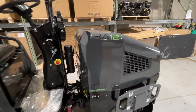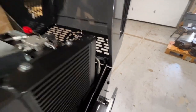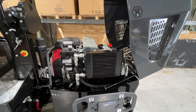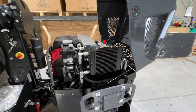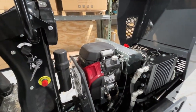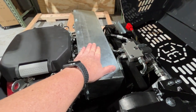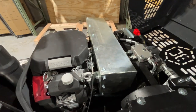Let's take a look under the hood and see what powers this bad boy. Fit and finish — very nice. Gas shocks. You have a nice oil cooler, which is definitely a premium feature not found on most rollers in this class. Definitely in the hot areas, on hot asphalt, this is really a nice feature to have. You have a Honda GX630 engine — a premium engine, easy start, plenty of power. Your exhaust is actually insulated and air is directed out through the other side.